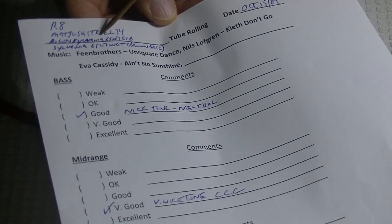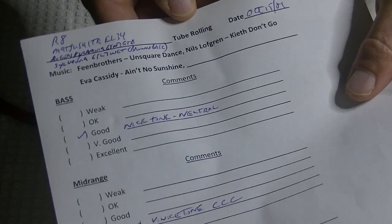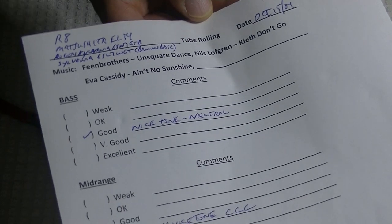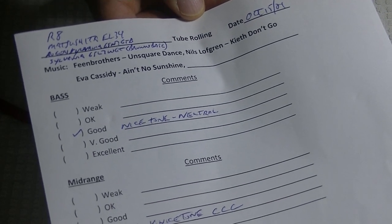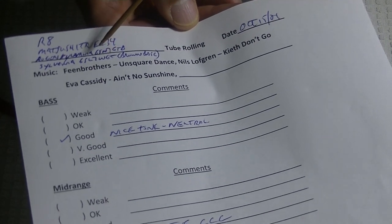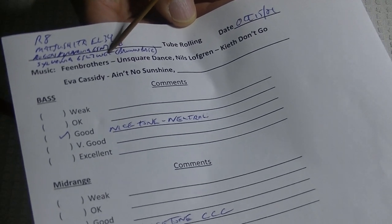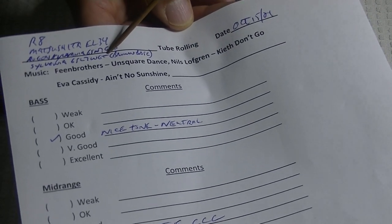They're a little bit more affordable, and because I've got lots of inventory that means I get good matches. Beside that, I've got the Sylvania 6SL7 WGT, which is a fantastic mil-spec tube — very low noise and fairly neutral for a 6SL7. It's a good choice in this case because I want to hear the Matsushitas; I want it to be as neutral as I can get.